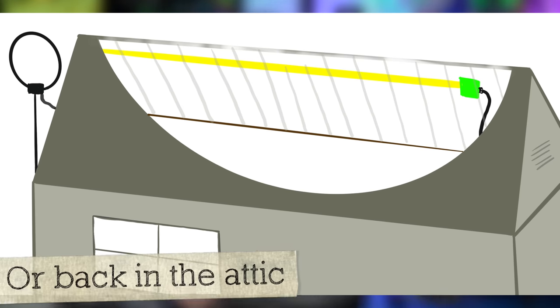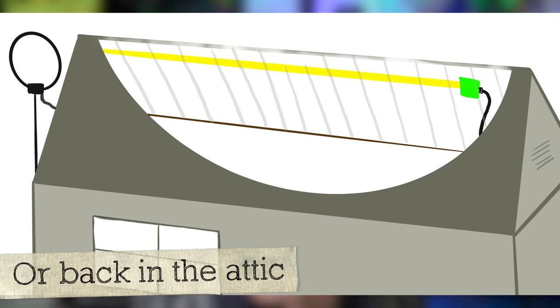People generally do better if the antenna is outside of the attic. The eaves are low, though, so it's going to act more like an NVIS — near vertical incidence skywave — antenna, where more of your RF is going up and then coming down. Keep that in mind. You could also take an end-fed and wrap it around the exterior of the roof, then use an external antenna tuner to get it in order. If you're going down that road, you'd want to look for a non-resonant length — what's called a random wire antenna. It's not truly random; it's just not a length of wire that will resonate in the amateur radio bands. Then we use a 9-to-1 unun or transformer to bring it into something that can be tuned with an external tuner.